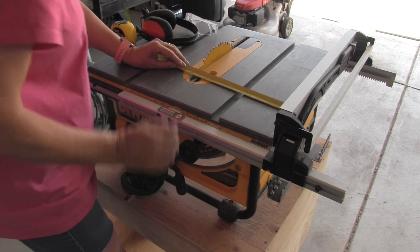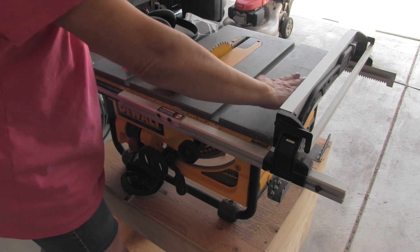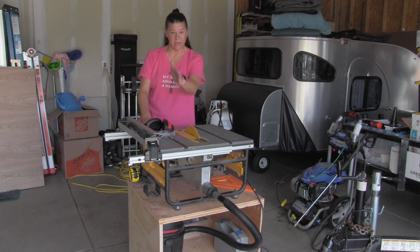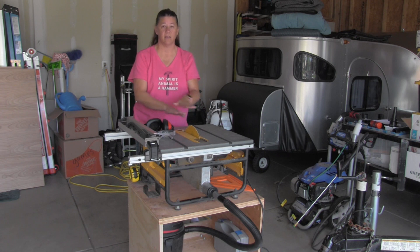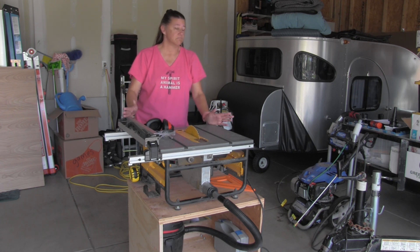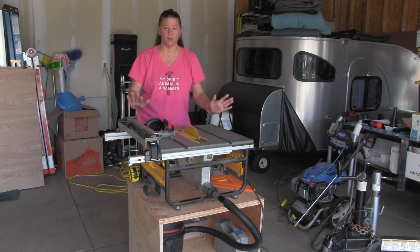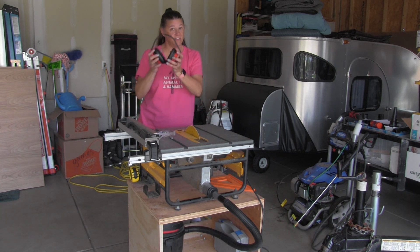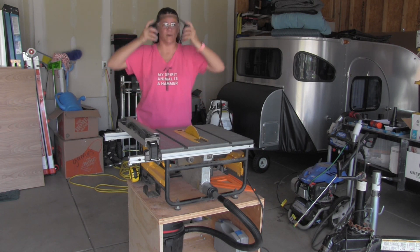I lock it down — this will make sure every cut is exactly 11 and three-quarters wide from the fence to the side of the blade. Right before I started cutting I realized my blade was slightly off, so before you start cutting make sure everything is set up exactly how you want it. It may even be a good idea to run a test with a scrap piece of wood just to make sure you've got everything dialed in. Once you do start making your cuts, that's the fun part! Safety first — always goggles and ear protection.